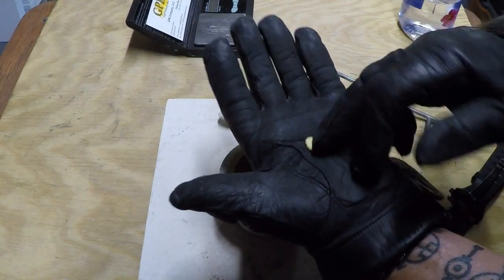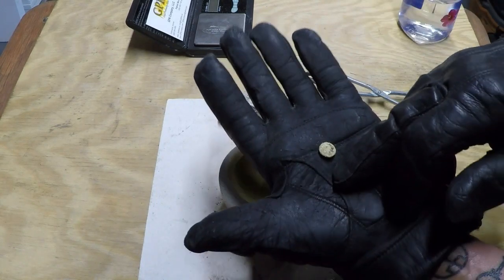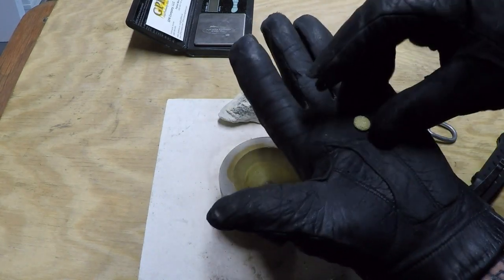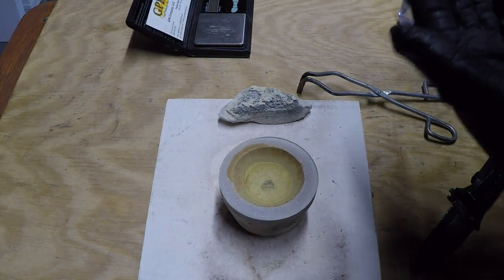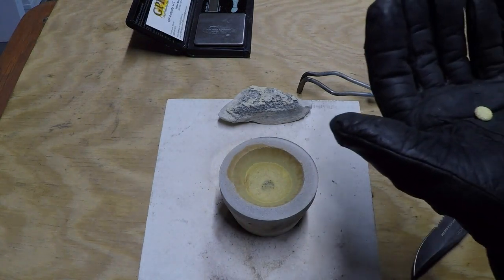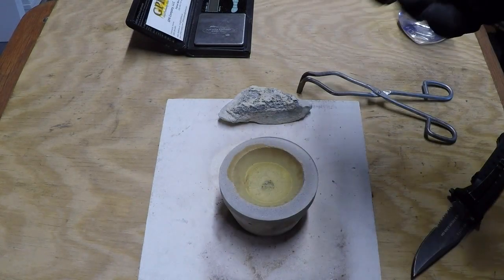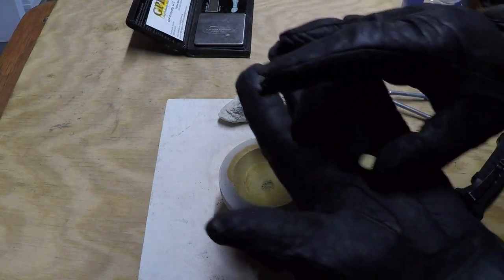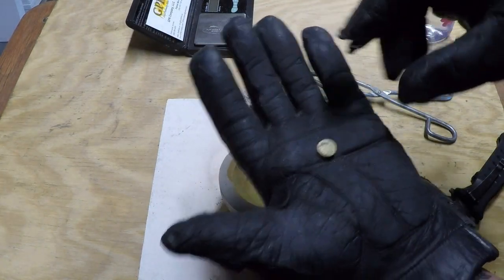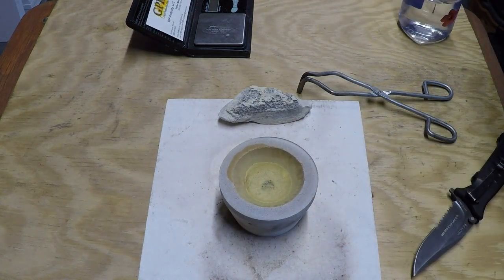It's frosted on the top because when this stuff blicks off, the cupel is actually lower than the temperature that gold melts at. So when all the lead is converted to litharge and gets absorbed by the cupel, it leaves kind of a frosty appearance on your beads. Of course, I'll flux that and remelt it and add it to the other ones.